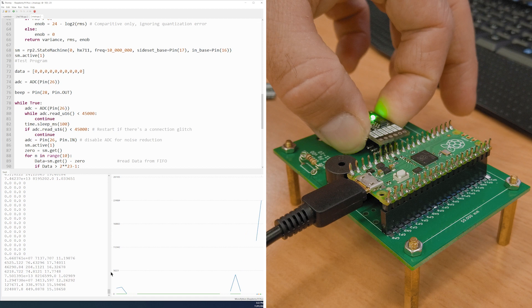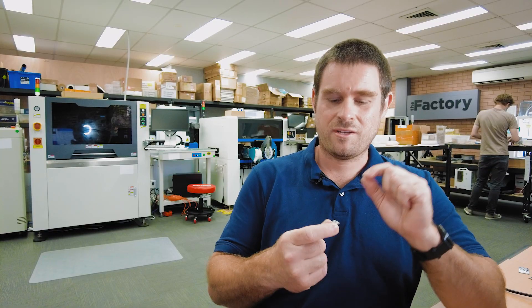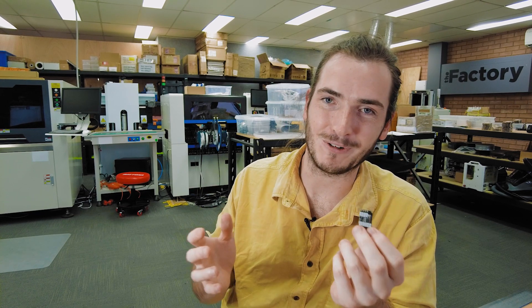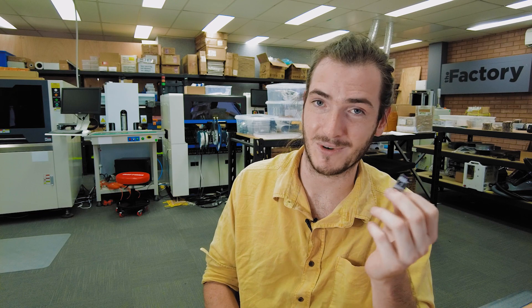In the test jig we've got pogo pins for the device under test, and a Wheatstone bridge made of 1k resistors as a dummy load cell input. We take a bunch of measurements and verify the noise is low enough. Testing an early prototype with a 100 nanofarad cap, the noise reads around 15 — it's got an oscillating reference and the noise is just too high. It's quite a deep dive into vetting a pretty simple electrical design, but the simpler you make it the more reliable it can be. Who would have thought that just removing a decoupling capacitor would make the design more stable?